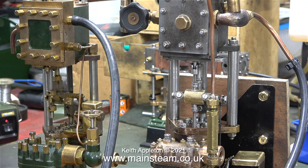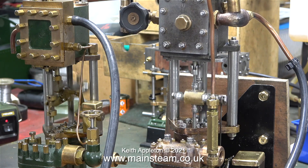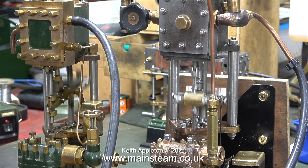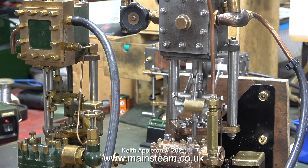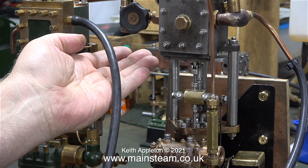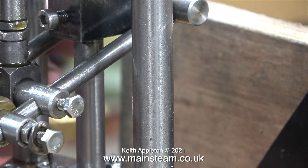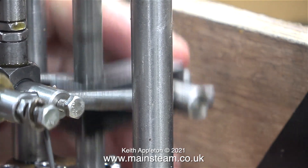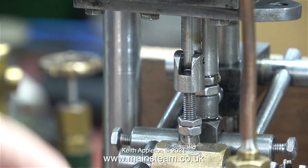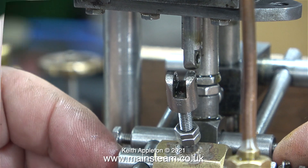Here's a direct comparison of both engines running. On Don's pump, the way the valve is driven is heavily modified from the drawing, and also on the pump on the right hand side, someone's had the smart idea to modify the way the block drives the valve. Here I'm having a feel at the exhaust pressure from both valves, and it's actually very similar. One problem I've had with this engine on the right hand side is that the mechanism has been stiff right from the start. Once again I need to partially dismantle the pump in order to fix this valve block — it's not right at all.